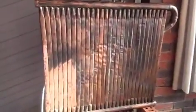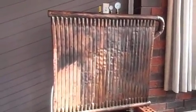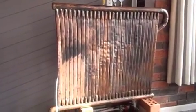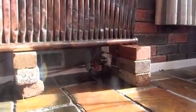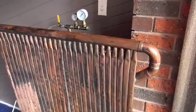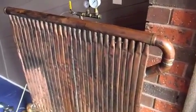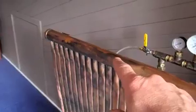When the water evaporates in the evaporator in the chimney, it comes up here because the vapour is lighter than the water. The vapour condenses here — this is the condenser. It comes in through the top of the condenser, goes back to liquid, and then comes out through the bottom, and then goes back into the chimney through this hole. The clicking noise you hear at the moment is the bubbling of the water from the evaporator up into the condenser. It can rock around a little bit when it starts moving, and then you start feeling heat in this top corner here, and the heat slowly moves across and then slowly down.